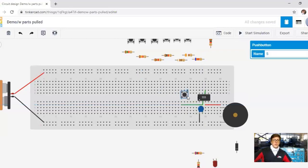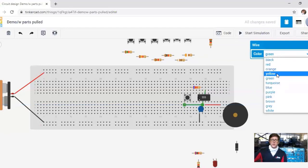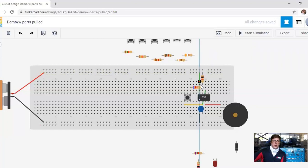We're going to put in a push button that bridges the gap just like the 555 timer. Then we grab the first resistor and connect it — five positions over. This gold-colored wire indicates it's neither a fully low nor high signal, it's in between. It goes to pin 2 and then up to the seventh terminal of the 555 timer. We jumper it to the power signal with a 1k resistor and a 6.2 kilohm resistor. Now the 555 timer has power.